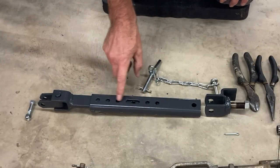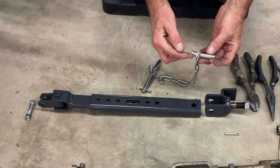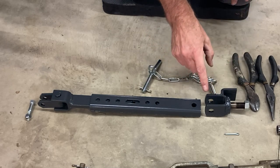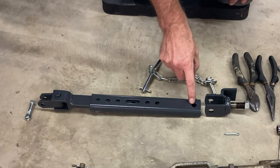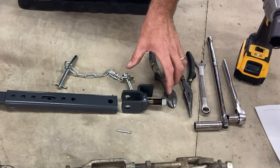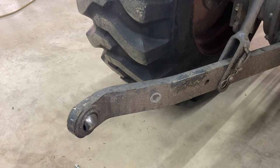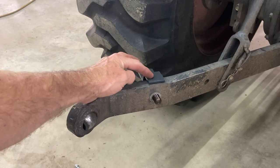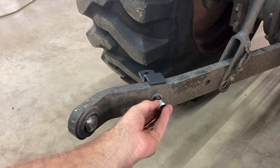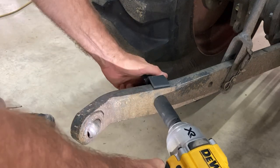This pin is the one you use for adjustments. It has a little keeper pin, and you use a washer under this pin through the larger hole in the chain. That connects this side to this pin hole and gets a cotter key. This end here screws directly into the end of your lift arm.